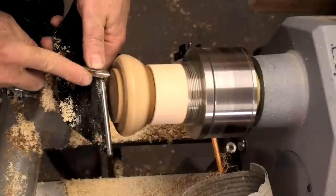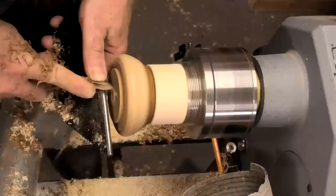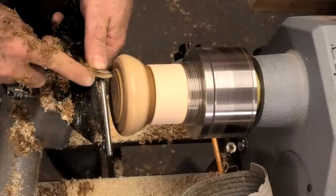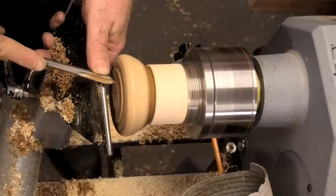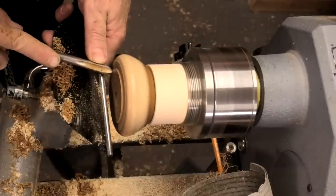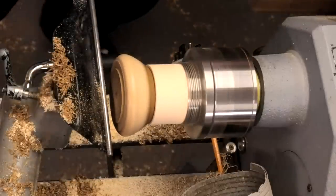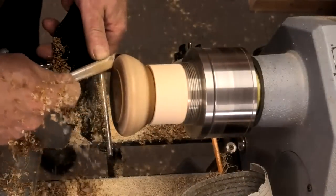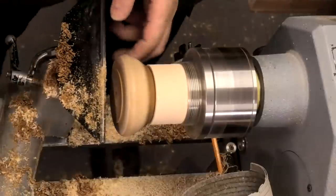This box shape — I've probably been making this for about 30 years. That's a scary thought! Thumbs working again, push across. Funny grip on the handle and on the tool rest — this is working nicely to give me a bit more control. I'm going to have something as a flat bottom. Nice — trying to pick up a little bit more, work to the middle. Come round to there — I've got a tiny little bit of that step left. Let's bring the skew in to lightly cut those fibers — I don't want to take too much more off. I'm blending into what we've already sanded.